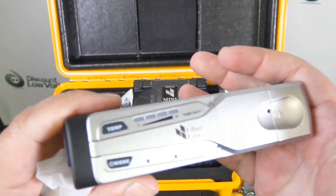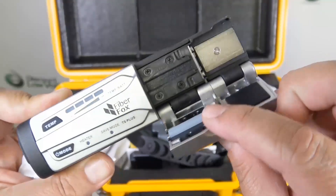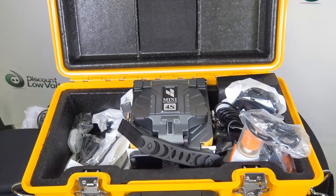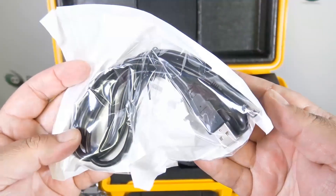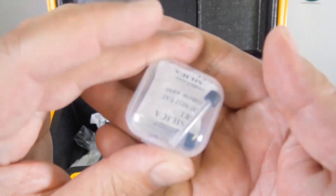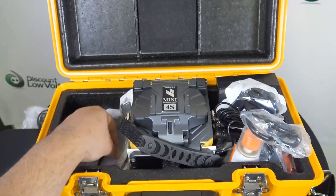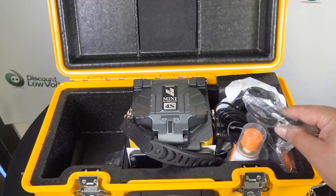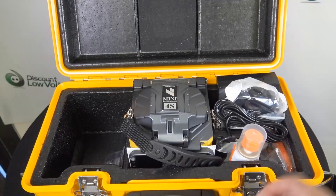Now there's the thermal stripper. I'll show you guys how to use that in just a sec — it's pretty cool. Looks like we've also got some cables: a USB cable for exporting the test results from the splicer to your computer. You also have a pair of extra electrodes. This does include a pair already installed on the splicer and you get an extra pair. There's also a brush — you want to make sure you keep everything clean internally. And there are a couple of miscellaneous cables along with the power supply cable and power supply for the splicer itself.